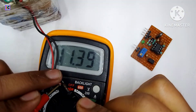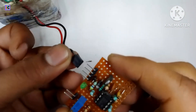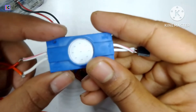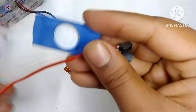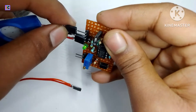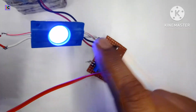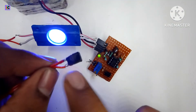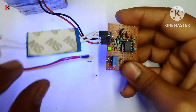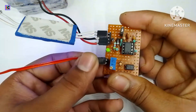You can see the voltage is 11.4 volts for our testing. I am connecting the battery to the VCC and ground input. For the testing purpose, I am using a 12 volt LED, and two header pins are connected — one for the output connection. You can see it is lit at full brightness because the feedback is not yet activated. Now I am connecting the feedback wire at the feedback input pin. You can see the brightness of the LEDs becomes dim as the feedback is activated.